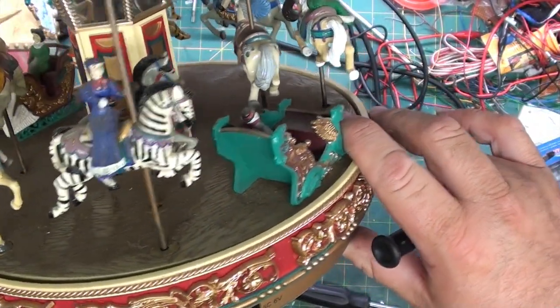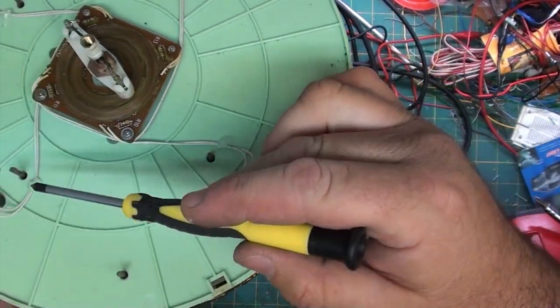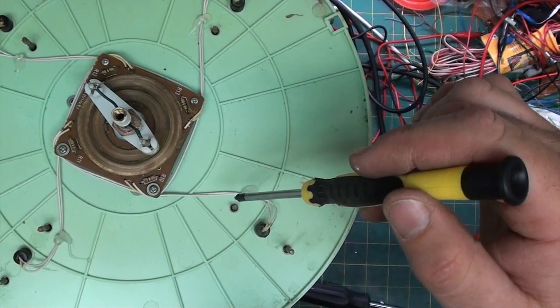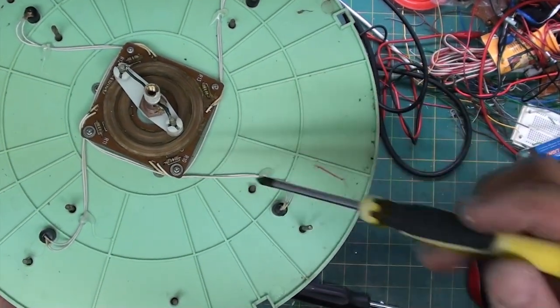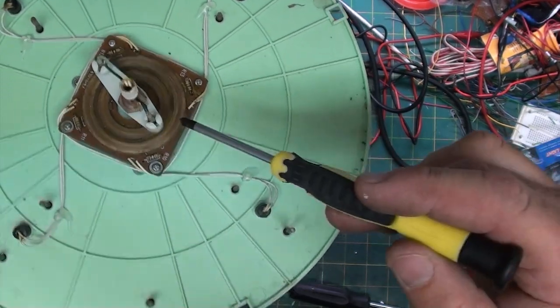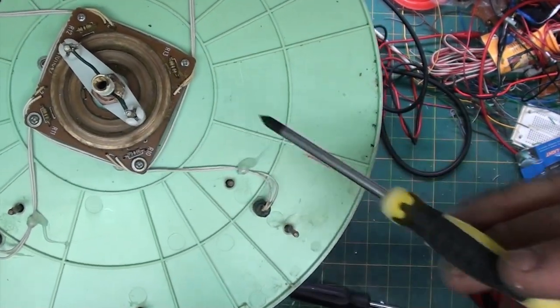They're not LED, they're actually incandescent, and since one of them's burned out, we'll probably just change all these to LED and change the resistors to match or add another resistor in line. So, but you have one rail which is negative, one rail is positive.